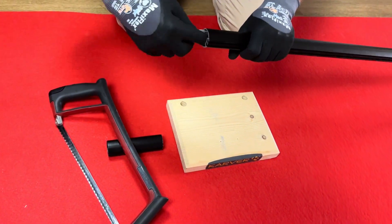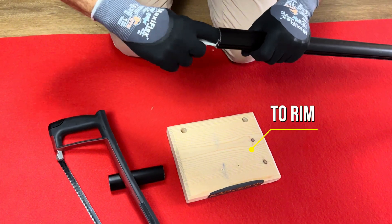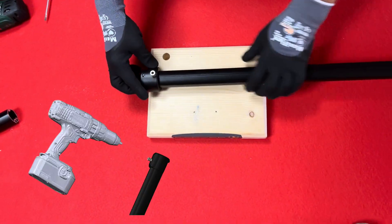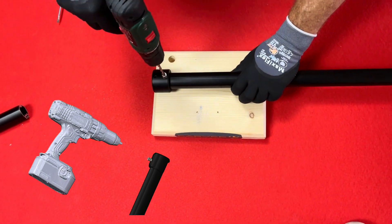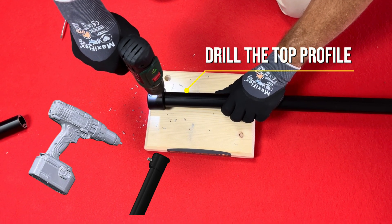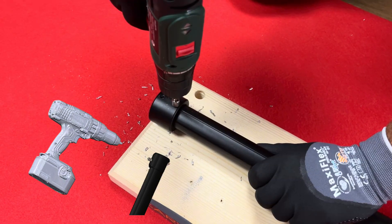After the cut, I'm filing the end profile with smooth sandpaper. As the top profile is cut, it has to be drilled in order to install the end components. I'm screwing a drill bush into the end stop to drill the profile. After drilling, I'm removing the drill bush.